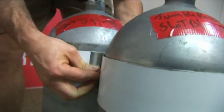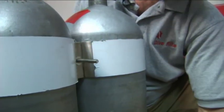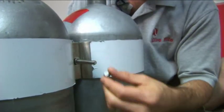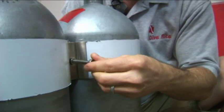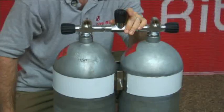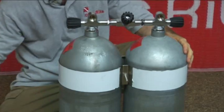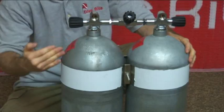Do this the exact same way on the top and bottom. On the front, put the flat washer on, put your lock washer on, and then your plain nut. Get that finger tight so the bands don't slide down the tank on you. Now we need to determine the height of the band — how high you want your bands is a personal preference. I like mine right where the tank starts to break, moving the top band up right along that edge. Then we'll measure 11 inches on center to get the bottom band in.